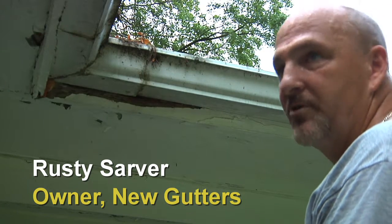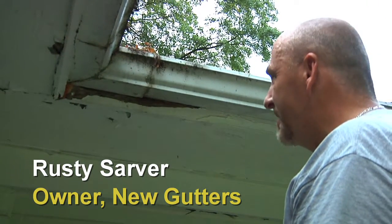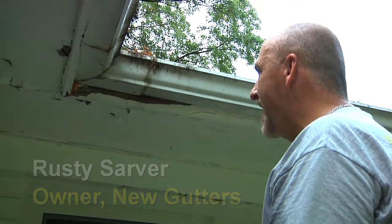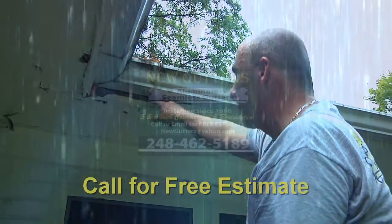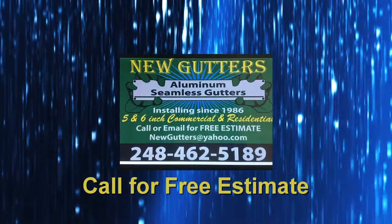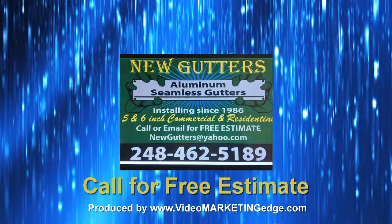When you're getting an estimate, make sure they're doing the best job they possibly can. They're going to replace all the wood so it's solid, so your screws will hold into something instead of into the rotted wood. If I just run a screw into this rotted wood right here, over time it's going to pull back out, and then your gutters are going to be hanging. So you don't want to do that. You want to replace all rotted wood.